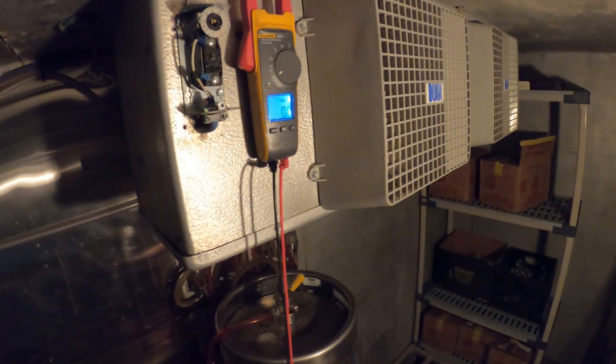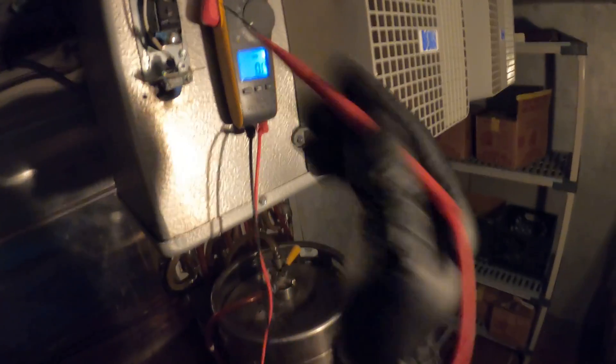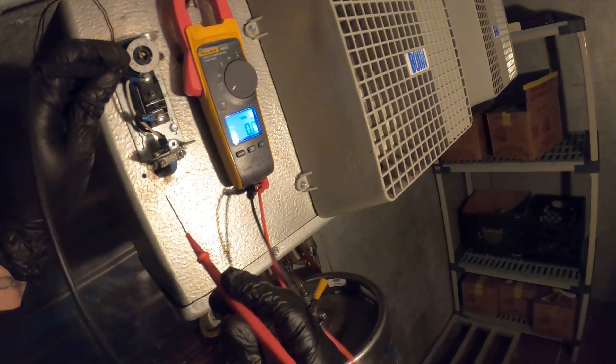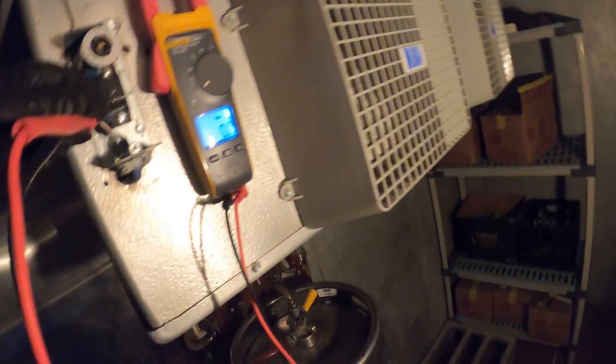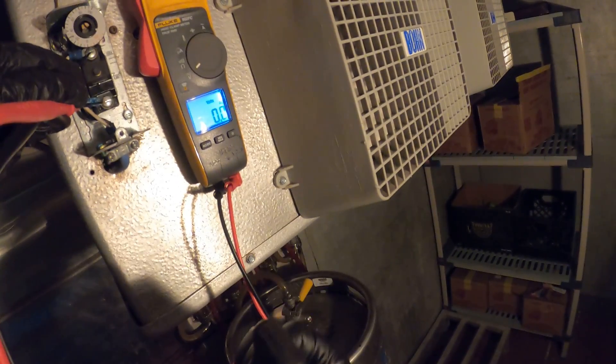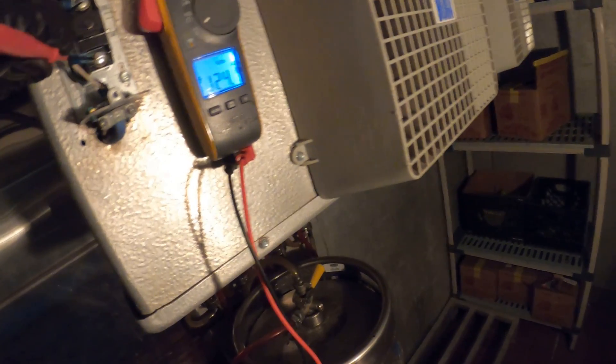You want accuracy. While the system is calling, if it's sending power through, you're going to have zero volts. Let's act as if we satisfied the box — we just satisfied it and we have 120 volts. So now we're open.